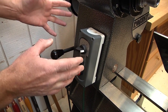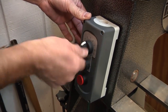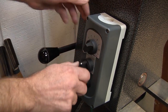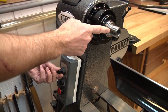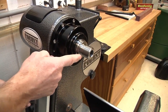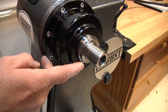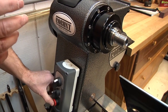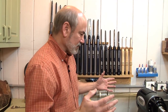When you're shopping for a lathe, one of the things I suggest you look for is variable speed — the ability to start from zero and bring the lathe up to any speed you want. This one's cool because if I turn it on, it's a slow ramp-up, so it's barely turning and then I can pick up the speed and see how the spindle moves. This little puppy will fly, but the thing is you want variable speed because it makes it very easy to turn.